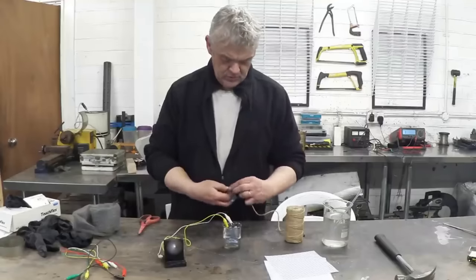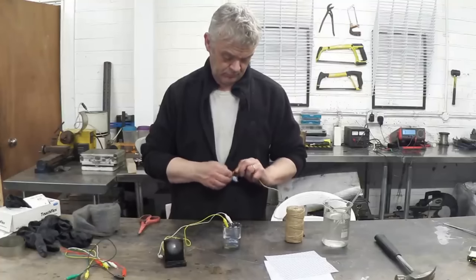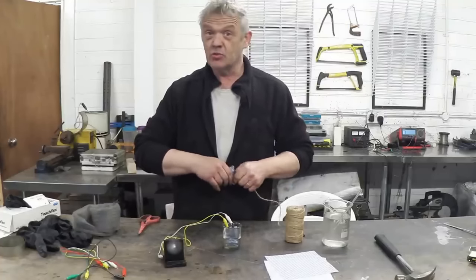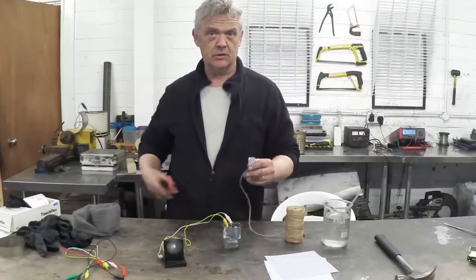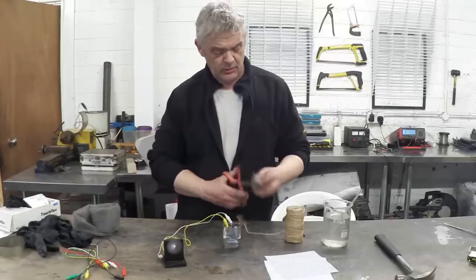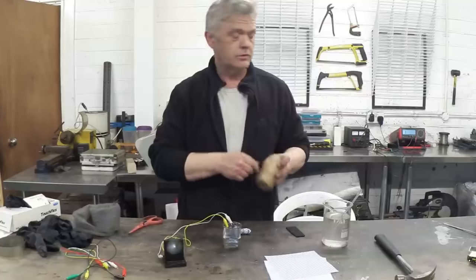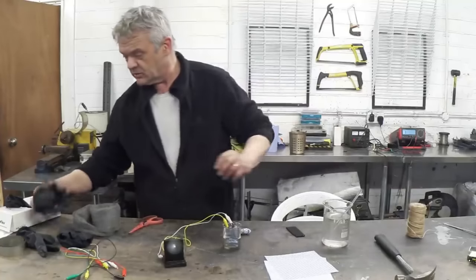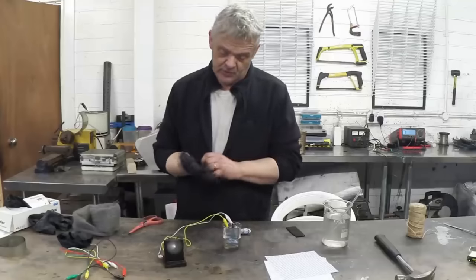Now, when we do this, what we'll effectively get is a hybrid supercapacitor, because we've got carbon on one side and metal on the other side that is being reacted with the KOH, and so we should be able to use this to make effectively a hybrid supercapacitor. But it is also along the transition line to nickel-cadmium batteries.